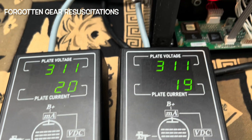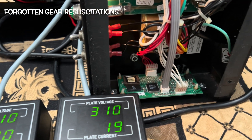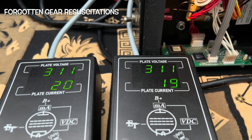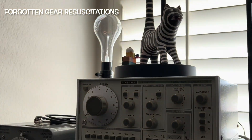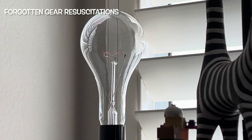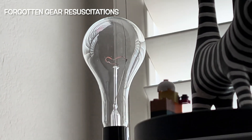All right, here we are. I had my first cup of coffee in three weeks and it's actually working. We have her new pair of tubes warming up on a current-limited supply. You can take a peek at the bulb, which is resisting the flow of electrons currently in series with the outlets. We don't have a short any further.